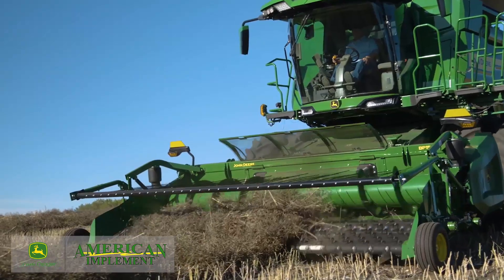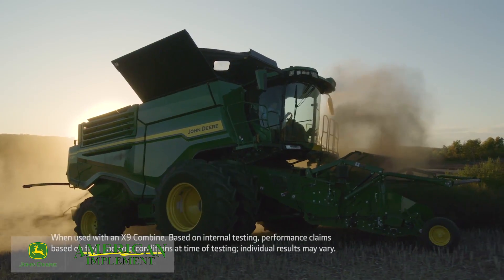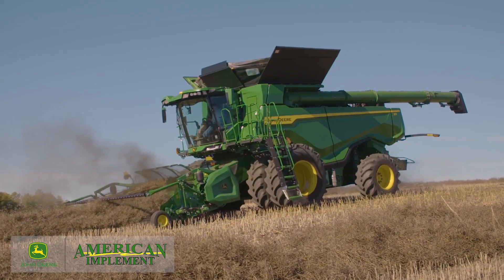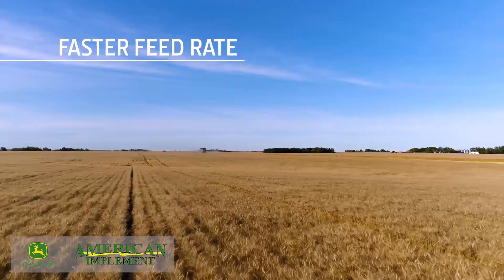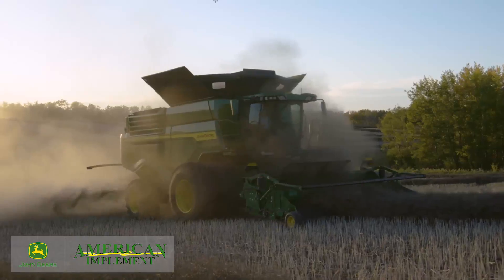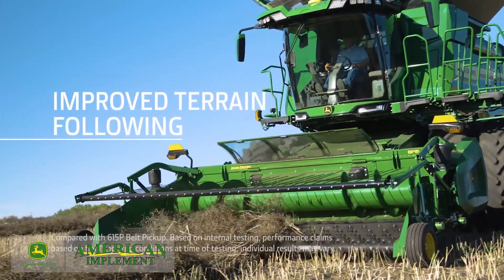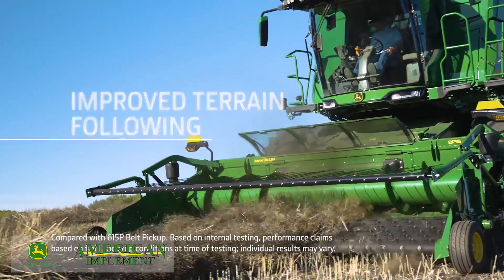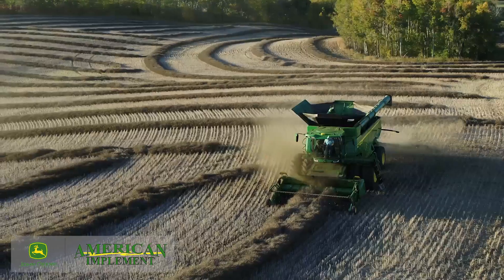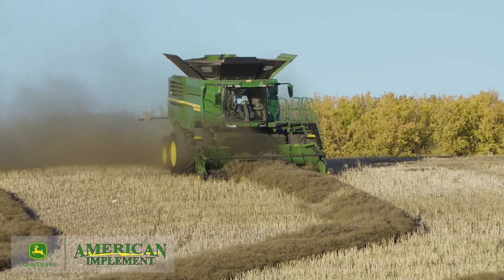For farmers who grow small grains and need a belt pickup, we offer the BP-15. The BP-15 can pick up 30 acres of wheat or 23 acres of canola windrows an hour. A two-speed auger drive sprocket provides a 20% faster feed rate for canola and high yielding wheat. We also offer a feed auger spacer to keep the auger position high when harvesting large windrows. Larger gauge wheels with a no-tool adjustment offer improved terrain following in rough field conditions. And you can add a crop shield to prevent crop from flying onto the feeder house or against the windshield.